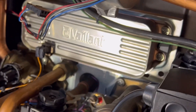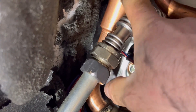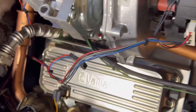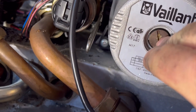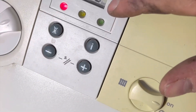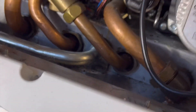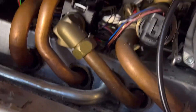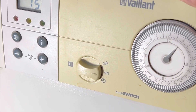On this one I've had an absolute nightmare. These pipes at the back - the older ones come with a rubber section halfway down - and they just burst and flooded the boiler. I drained it down, made it safe, ordered parts, came back and replaced them. After filling back up, the pump was stuck - I freed it off so it's running nice and strong. Then it was coming up with F75 low water pressure. Testing it with the minus button, it was reading 1.3 bar but saying 2.3 bar, so I changed the pressure sensor and that's now resolved. The boiler is getting to the stage where we can give it a demand.